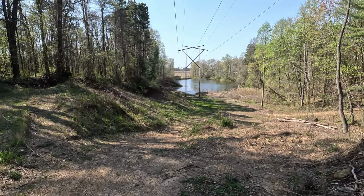So most spots they didn't have to put in too much gravel, but like here there's kind of a low spot, so they had to put in extra gravel, and still it's kind of seeping through. And then this area up here, they had to do quite a bit too, because it was sloped a little bit, and we had a pretty decent hole right here where the stump was. So there's quite a bit of gravel here. And it looks like they put some 53s in here to help hold this and kind of build this up.